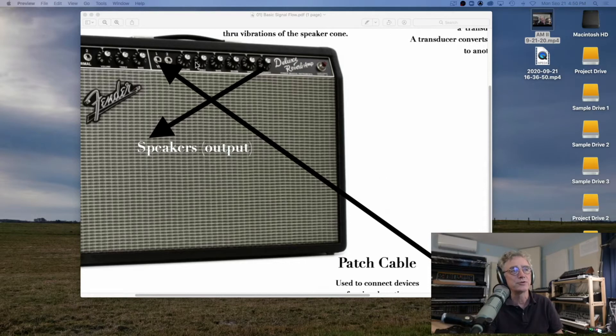That input has a pre-amplifier. The pre-amplifier sometimes has controls for tone — treble and bass — so you can amplify or attenuate. Attenuate means bring the volume down. That then goes into the power amplifier, which brings it up to a level loud enough to drive the speakers. The speakers are also a transducer: they take electrical energy and change it into audio waves, vibrating in and out to create the sound that comes out.